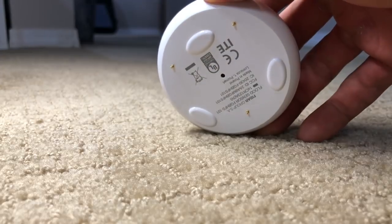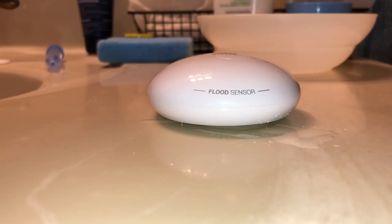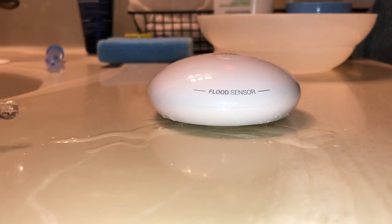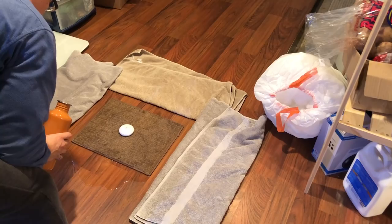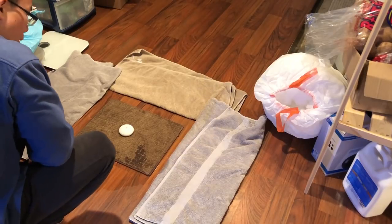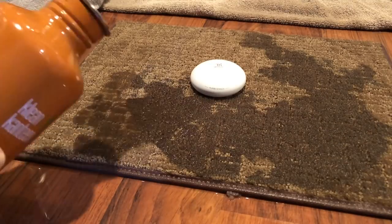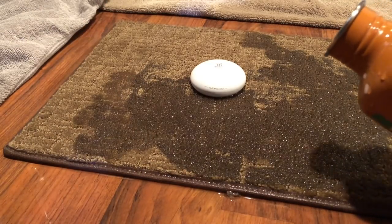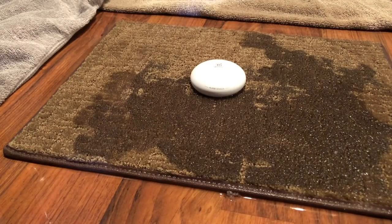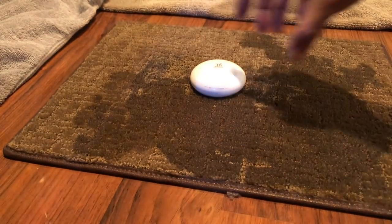The short answer is not really. The Fibaro sensor triggers on water contact — it needs a solid bead of water to hit one of the leads before the unit triggers. With carpet, that only happens when the carpet is completely soaked through. I did two tests: first, I took a carpet sample, placed it on a flat surface, and poured water along the edges — the carpet didn't absorb it well, so I poured water directly onto the sample. In order to trigger the unit I had to pour the water right beside it and really soak it. It took a couple of pours before there was enough water in the carpet for the Fibaro flood sensor to trigger — in total I used about two liters of water.